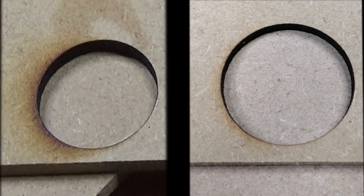This is side by side about 10 minutes later. Sorry about the one on the left — that is just ripped from the actual video; I didn't take a photo beforehand. The other one is a high-res photo. Tip three is possibly and probably the most important, and that is keeping your laser clean — not the actual innards of the laser, but your mirrors and your lens.